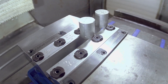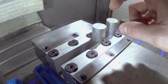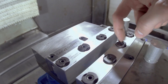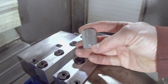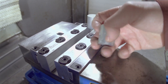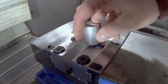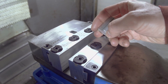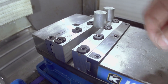For the first operation jaws for the collars, I'm holding four pieces at once just like before, but this time using Versa Grips. When you tighten these down, there are little teeth that bite into the part — you can see these ones have a little bite taken out of them. You're not really relying on the exact dimension of the part as much. Whereas before I had a smooth pocket and was worried about parts getting ripped out, even if the parts are slightly different sizes, they're still being bitten by the Versa Grips for a more positive hold.